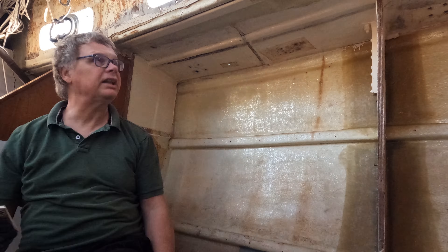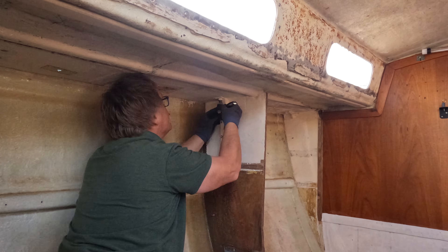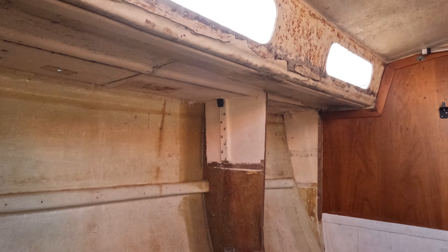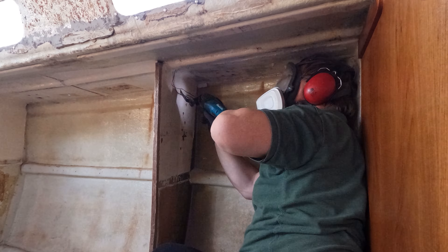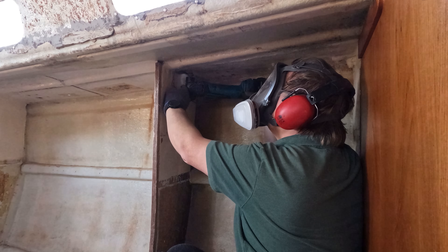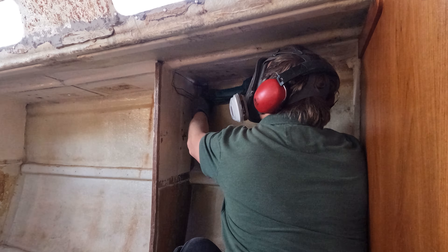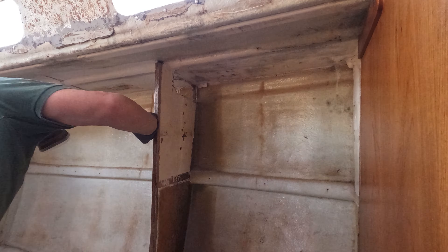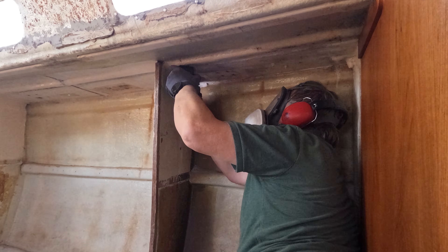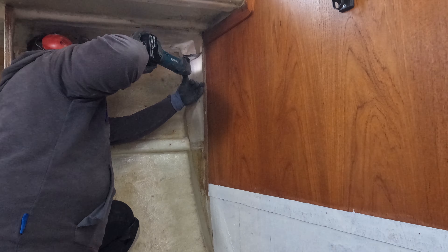We're going to have to take this off, cut a hole that size in this bulkhead so our backing plate can go right the way through. And then the forward one here - again we're going to have to cut out parts of the bulkhead to get our backing plate through. As we cut it out, hopefully this fibreglass that's been added around the bolt we can cut that off, get the bolt out, and then fit the backing plate in the same way.